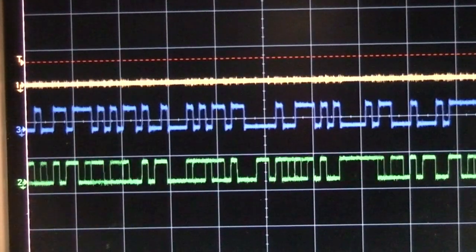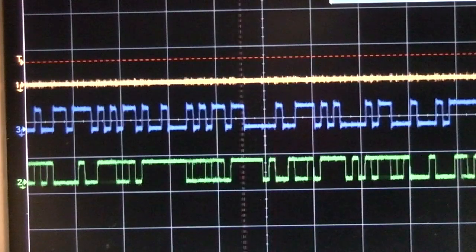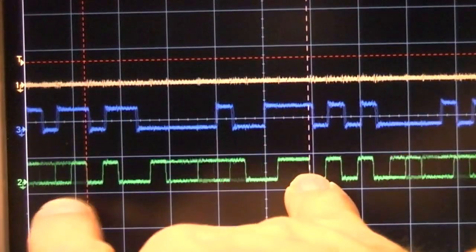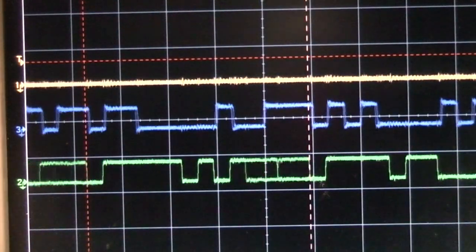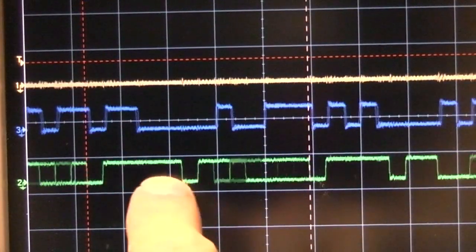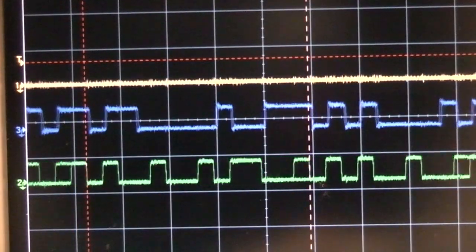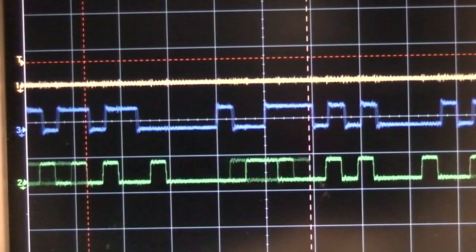And I think that looks like it's probably binary, so if we can find the boundaries on that. Yeah, so I think that's probably the framing. So we've got all the least significant bits here. And as I put the soldering iron into the field of view, you can see clearly we've got a binary count going up, with the lower bits here and the more significant bits at this end. So it's heating up now and cooling down.